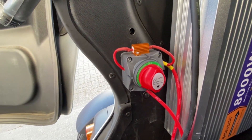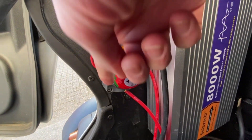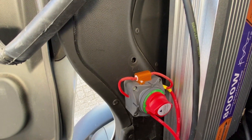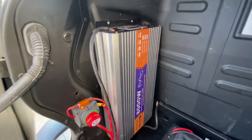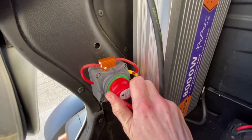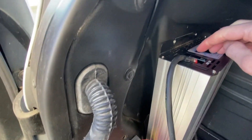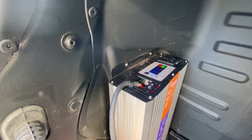It's a special switch. If you put it on number one, it will go through this one — it's like a 25 watt resistor. What this does is pre-charge the capacitors of this really big inverter. So I can put it on two now and it goes through the normal leads straight into the inverter. When I put it on now, there are no sparks and it's all safe.